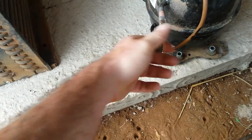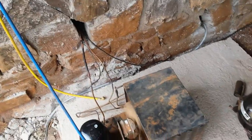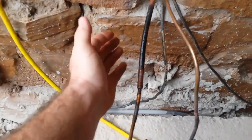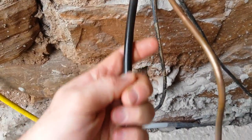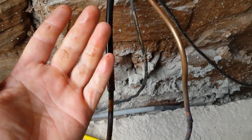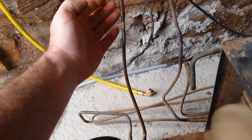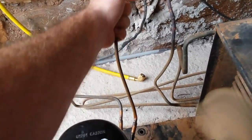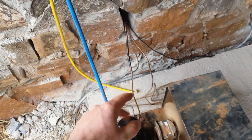It's not just about air in the system. A lot of people will tell you that there's moisture build-up inside the pipe. Moisture is bad because the moment it gets stuck inside the lines, it basically freezes. The gas runs at a very low temperature and once it freezes, it clogs up the system. This is the suction line that comes back to the R600A compressor and as you can see it has a lot of damp on it. According to what I know, this is perfect. The reason is: once your suction line freezes up all the way to the compressor, you know you've over-gassed your system — the pressure is too high and it's freezing. But when there's damp on the pipe continuously, it means your system is running at an optimum temperature, making it as cold as it possibly can.